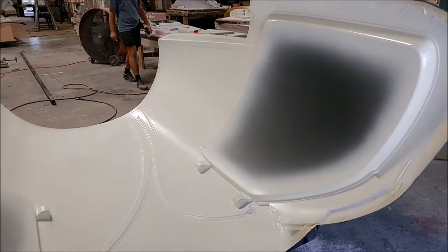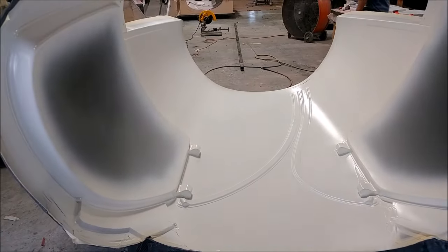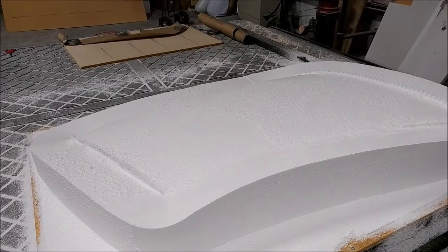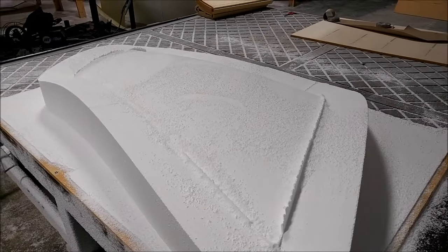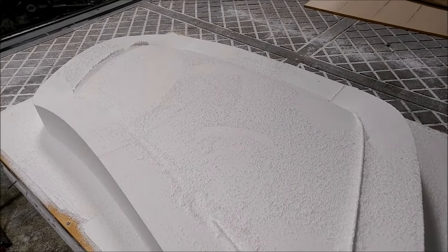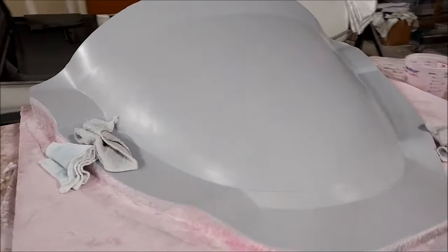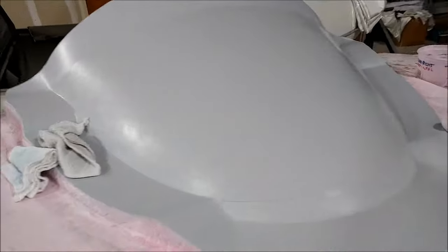There you can see the finished upper fuselage — it's quite large. Once we flip it over and put it on the lower fuselage you'll get a real feel of how big the cabin is. Here's the plug for the lower door skin, pretty much complete — just needs some finishing around the flanges and the cutout for the door handle. And here's the plug for the nose compartment door, all waxed up, just needs the rubber channel profile put on before the mold can be laid up.